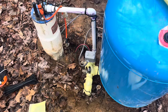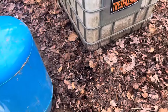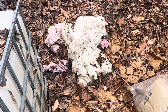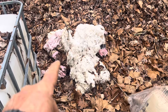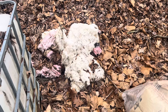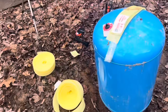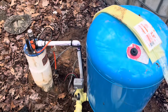Now, we're wrapping this wrap. I don't like to use the wrap they sell at Lowe's and the big box stores, because fiberglass insulation absorbs moisture. That's what they had wrapped around the top of this well with the plastic rock on it. What happened was condensation — because it's cooler under here and the sun would shine on it — got all that insulation soaking wet, and then it doesn't do anything as insulation.